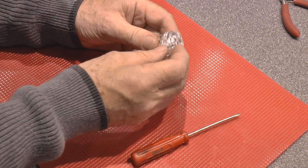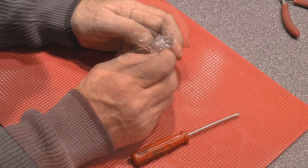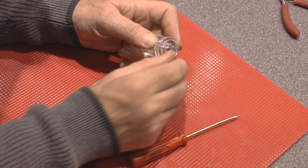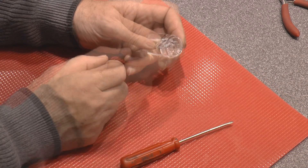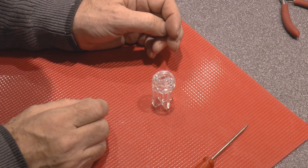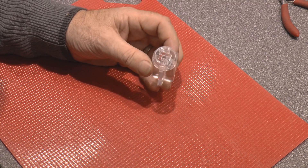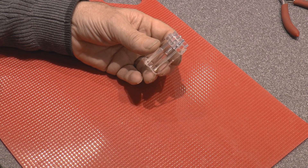I happen to have 16mm M3 screws here, and that means they project out the end of three pieces of 5mm material by about a millimeter — that's enough of a projection to sit in the drive holes. I'll send the files to the RDWorks Lab forum.